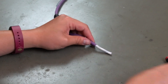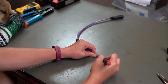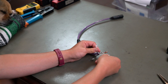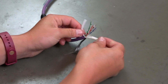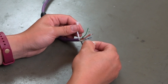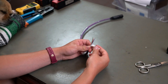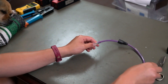The next part is that we get this little rubber bit. I use this tool — it's just like a little pick friend. You kind of just get at it; there's no great technique to this. You kind of just work your way down slicing it. I suppose that you could use a razor, but then you run the risk of cutting these little tiny wires, and you don't want to do that. I find that a little precision pick tool works really well. Then we get to this little part where you can see there's rubber and this little cotton. I don't really understand the cotton — I know these cables were chosen because they're really good for this whole adventure. I guess that the cotton is anti-stretching, so we don't need it for here but it helps with stretching in the rest of the cable. And this little rubber is just little rubber shielding — you just snip that off too.